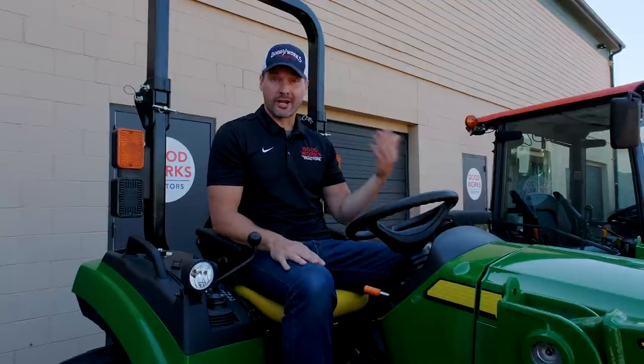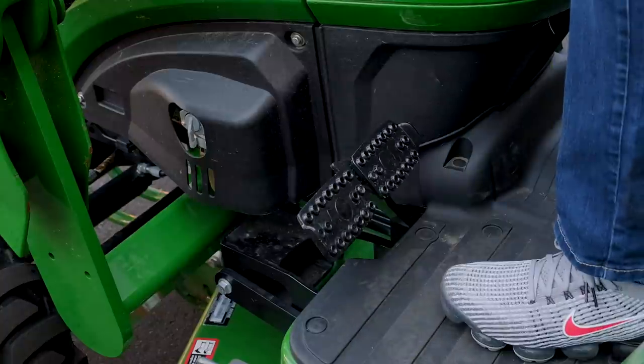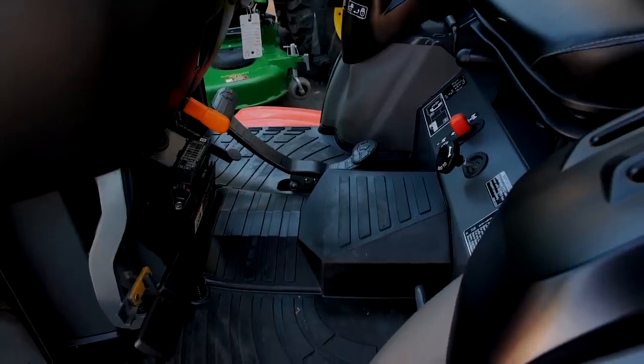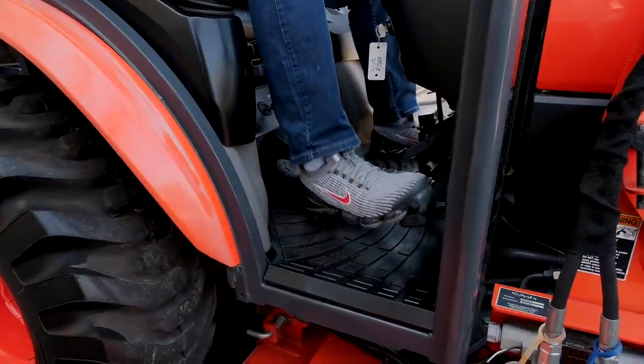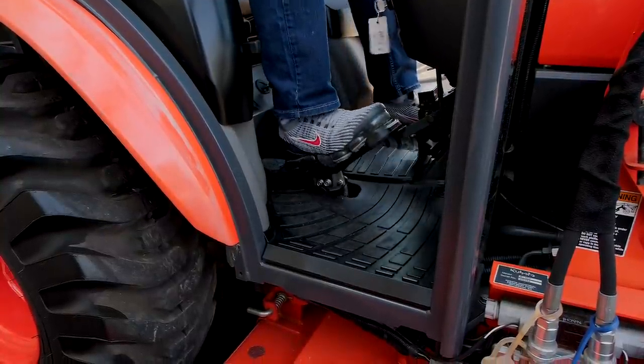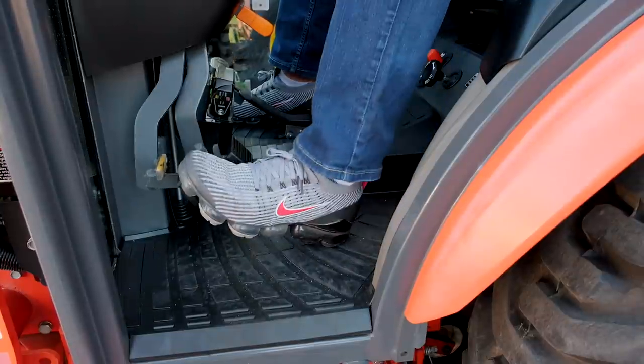One consideration is how you make the tractor go forward or reverse. With the John Deere, you have two side-by-side pedals — a forward and a reverse — plus a split brake on the left and a pretty open floor space. On the Kubota, you have a single treadle pedal for forward and reverse, operating it with your toe or heel. It takes up more of the floorboard, and it's not my favorite, though most folks get used to it. Both have split brakes that you can combine as one or separate for enhanced turning radius.